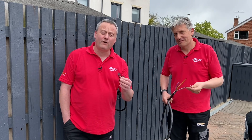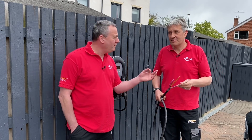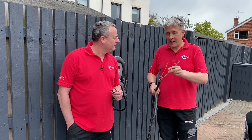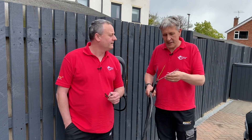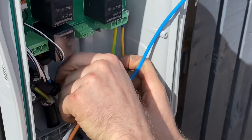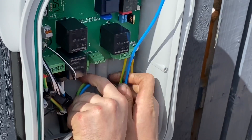There are two versions of the EV Ultra: one with Cat5e and one with a single twisted pair. Use the single twisted pair when connecting one current transformer to the EV charger. For the Cat5e, the obvious use is internet connectivity via Ethernet, but many chargers also have wireless connection to a hub. This charger from My Energy can support up to three current transformers, and you can use three of the Cat5e pairs to wire to those transformers.